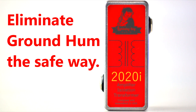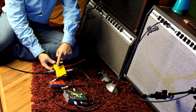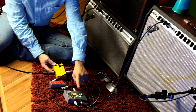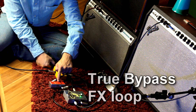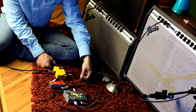If you don't, then the solution is to actually ground both amplifiers properly and use an audio isolation transformer in between one of the amplifiers. The instrument needs to have a reference to ground at some point — you just don't want more than one. So in this scenario, we've got a cable going to one amp, and then at the splitter box the other cable goes to the 2020i and then to that amp, basically isolating the ground at the audio signal level while allowing both amps to have the ground. So we eliminate that ground loop hum and we have safety as well. That's a great win-win.